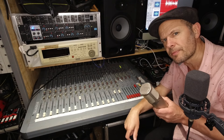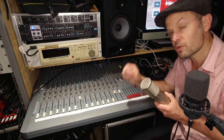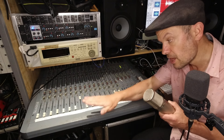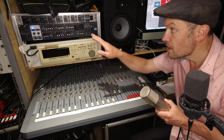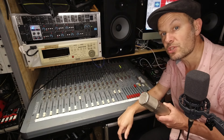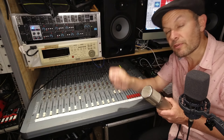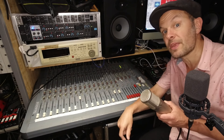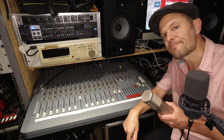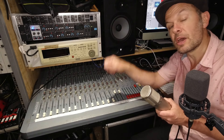It's all analog so far — there is no such thing as direct digital, because a microphone is an analog piece of kit, and so is a pair of speakers or headphones, or indeed the entirety of this mixer. The preamps on this are also analog. The signal only gets converted to digital information once you've passed the gain stage — the level control — and then the computer does the rest.